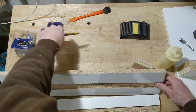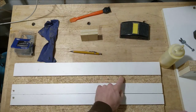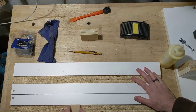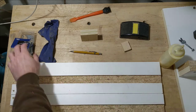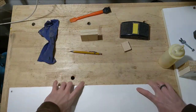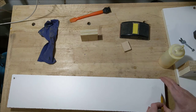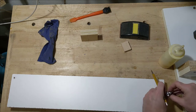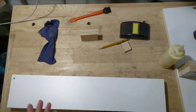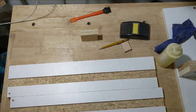I have to clean up those cuts a little bit with a chisel because I don't have a finishing blade — just a general all-purpose rough cut blade. The size looks just about right for the block to slide through. I'll clean these up, then glue and screw them together, and after that cut the slit that allows the bolt to slide through.